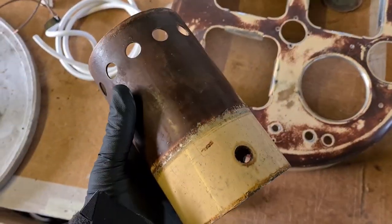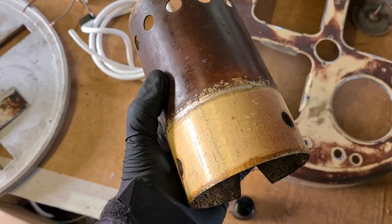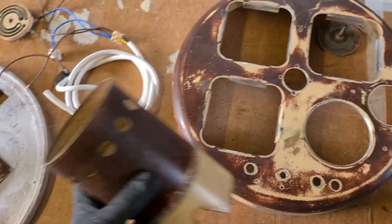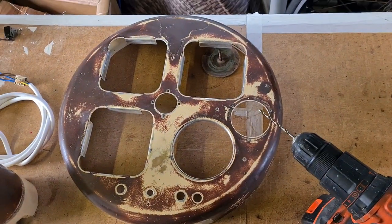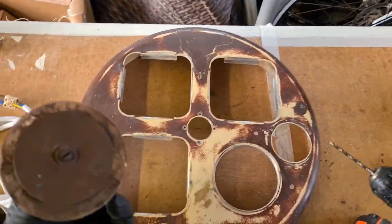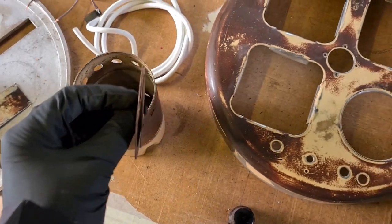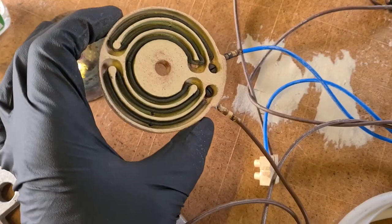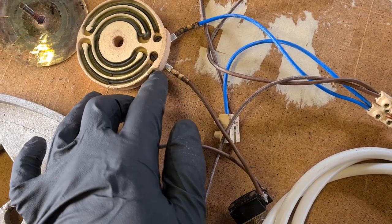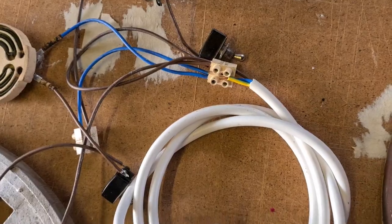The bulb was knackered, so these two wires are for the bulb which I need to solder in after it's fixed into place. Aside from that everything else was pretty straightforward, and all the old wiring was very ropey. I've retained the old chop blocks because they're actually in pretty good shape. The heater surround pops out — that's going to have to be sanded as well. A lot of it had cream paint that had just turned to goo, I presume from extended exposure to watch cleaner materials. The asbestos on the bottom of the heater — I've got rid of that. The heater itself is basically just a coiled wire with little porcelain washers to protect the wiring from heat.